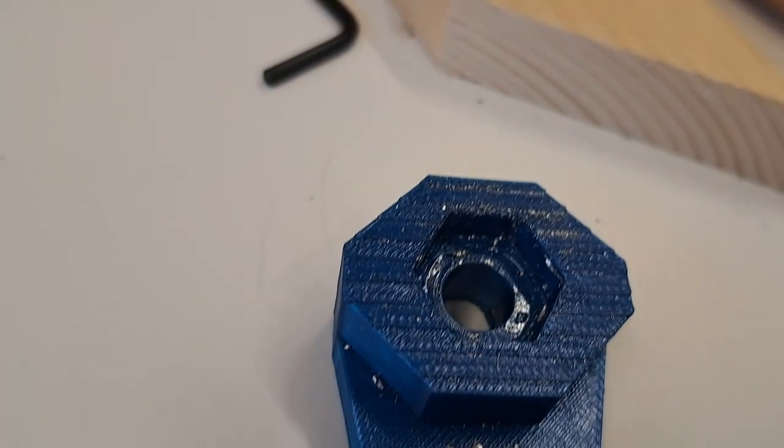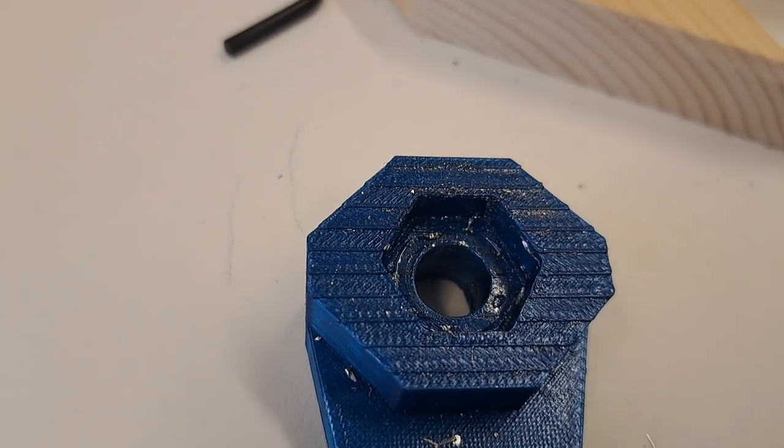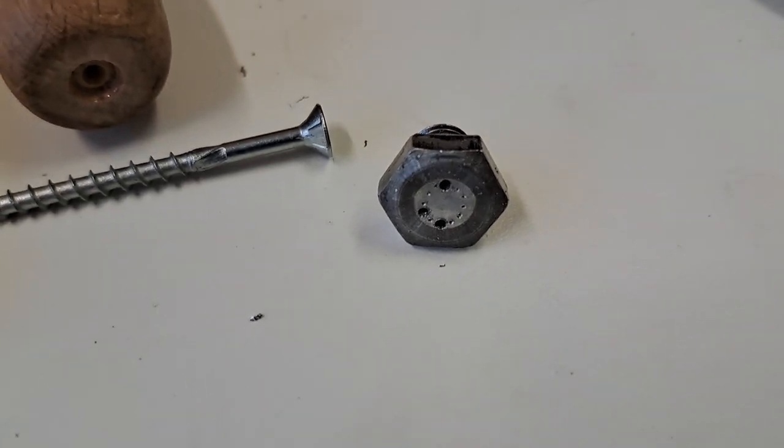When you're drilling into a bolt that's really small, it tends to get really hot really fast. This is usually no problem — the bolt is totally able to handle the higher temperature — but if it's sitting in a plastic mold, the plastic kind of starts to melt. So unfortunately, we ended up deforming our drilling mold in the process of making this part, and that hampered our ability to get really good precision while drilling these holes.